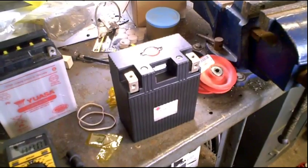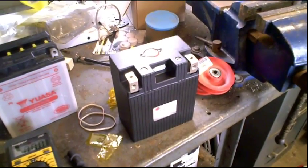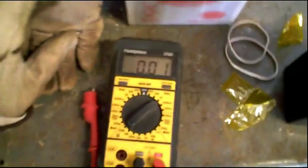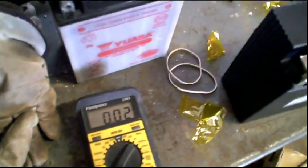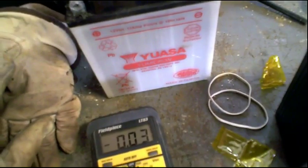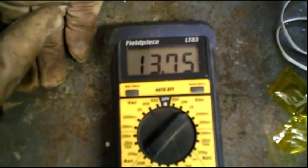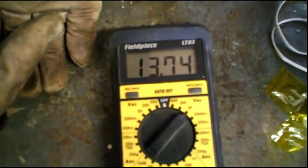I would expect a voltage somewhere in the range — since 14.4 volts is max charge, I would expect some drop back, maybe 13.8 or so. So let's put it on my test meter here. This is a Fieldpiece meter made by the guys who used to work at Fluke Meters, so I consider it to be fairly accurate. The reading is 13.75 — I'd call that 13.8. So I will agree this battery has at least 99% charge if not 100. I would call this 100% charged, so we're going to give it the best test.